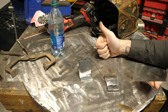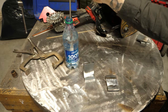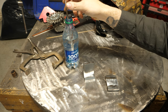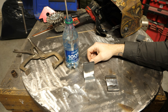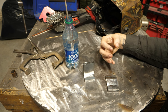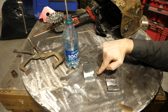What I have here is a 7018 that has been marinating in a bottle of water for four or five days. The flux is completely saturated with moisture - you really couldn't get any more in the flux if you tried. We're going to test whether or not all that extra hydrogen that finds its way into the weld pool from this wet rod is going to affect the bend strength.